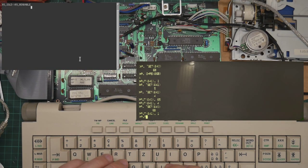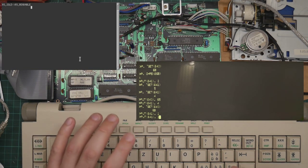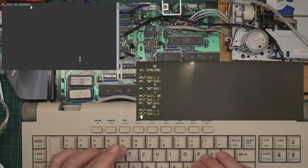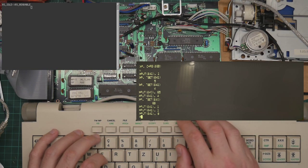Okay, I added some more tracing just to log the acknowledge bits whenever they are non-zero, so we should be able to see the ACK bits actually show up. And they do not. So I think that my status registers are not working. So that would be a job for the bus interface, I think.